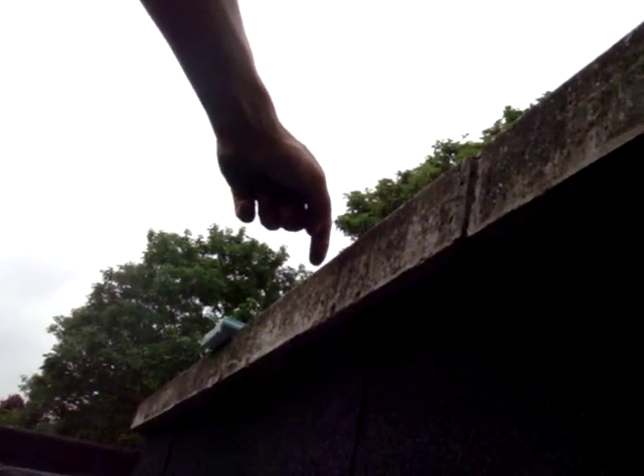I don't know if whoever did this roof realises the significance of what's happened here, but this drip here is such an important part of a roof. As you can see, they've taken the felt right up past the drip. With the complete negation of any water that runs down, it comes across there and it's just going to get right underneath and run down the back of that.